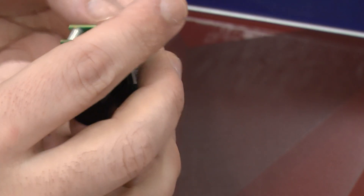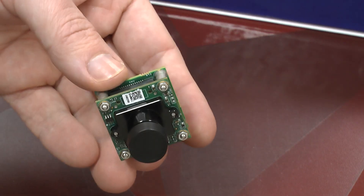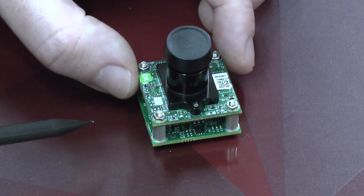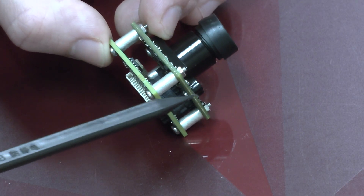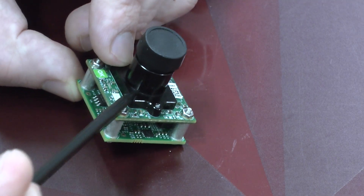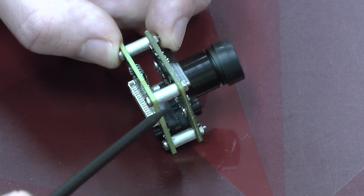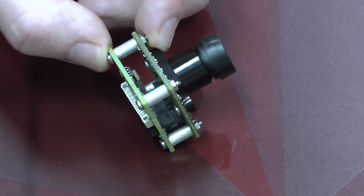And this is the actual camera, which we are going to look at in some detail right now. What you need to understand is that Econ Systems are actually not only in the turnkey camera business, but they also design custom cameras. And to make their work easier, they use a modular approach. Here on top we've got the lens, then we've got the actual camera sensor, which sits here on the first level acquisition PCB. And then below we've got the second level interface PCB. These spacers are metal — this is in general quite a nice design.